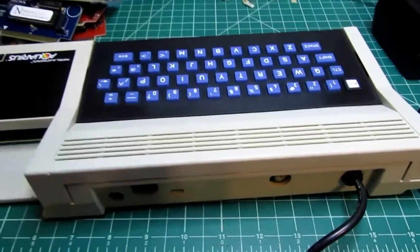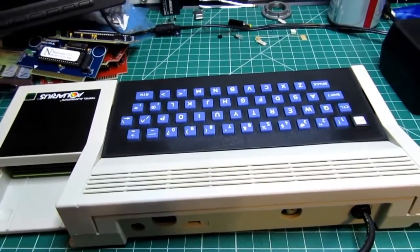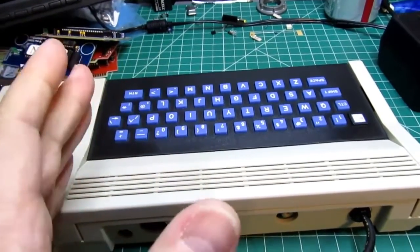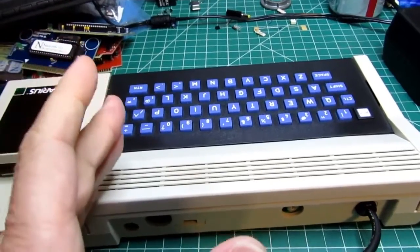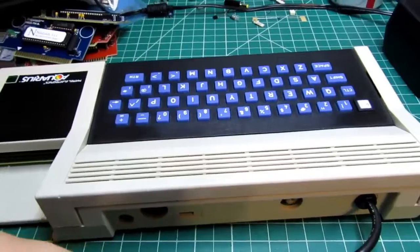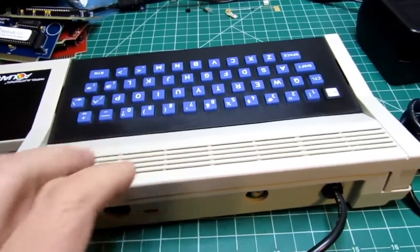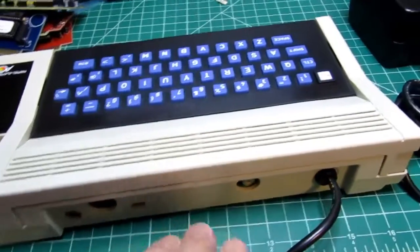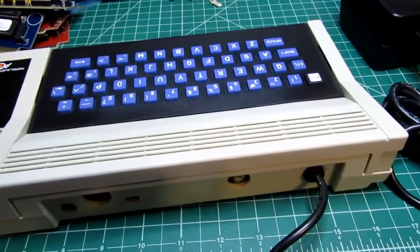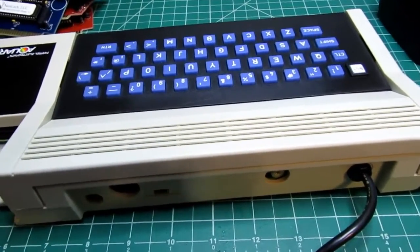And I've done a little poking around online and realized from that there's a composite video signal and a separate monaural audio signal available inside of here at conventional levels, and all I should need to do is to disassociate those signals from the internal video modulator, put another jack or two on the back here, and with that I should be able to extract those signals.